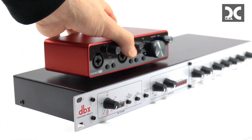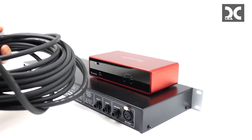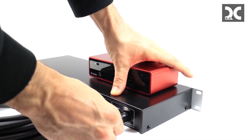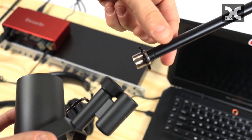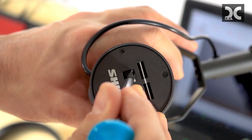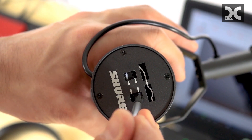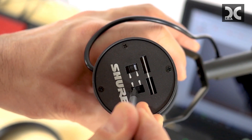Now I'm going to walk you through setting everything up. Start with the microphone preamp and the computer interface. Get the microphone cord and hook it to the microphone, then plug it into the microphone input on the back of the preamp. You can experiment with the frequency shaping switches on the back of the microphone using a small screwdriver — there's a switch for bass roll-off and one for mid-range enhancement, giving a total combination of four setups. Right now you're listening to the flat setup with both switches turned off.